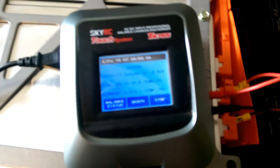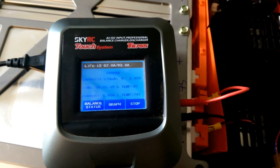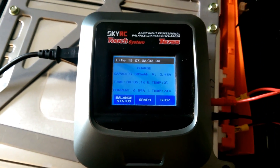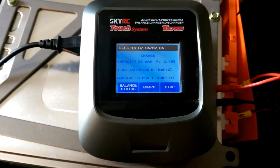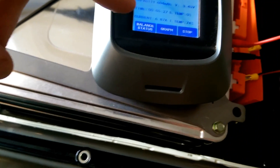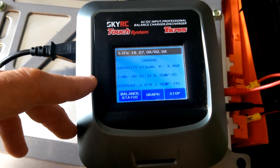The worst two were 72 and 76. Using the good old SkyRC hobby charger, I've managed to get the absolute worst — cell 72 — up from a terrifying 0.7 volts up to 3.3 volts, which is a similar voltage to all the other bad cells. I'm now doing the same for cell 76, which was the second worst at about 1.2 volts.